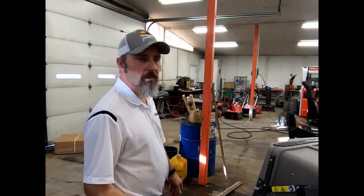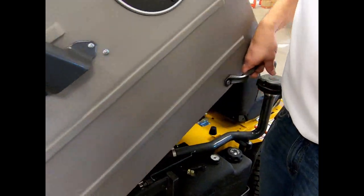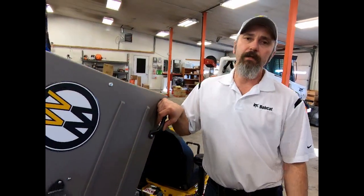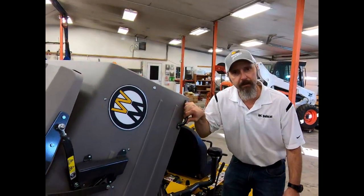When you're full of grass, this is how you go about dumping it: lift this tailgate, come over to this handle, and lift it up — simple as that. There are also kits you can install that will automatically dump it. There's even a power lift kit that lifts the hopper off, pushes it back, and dumps it into the back of a truck or whatever you're dumping into.